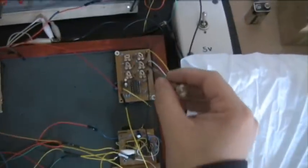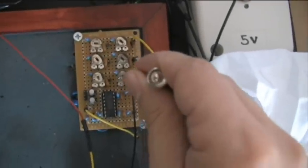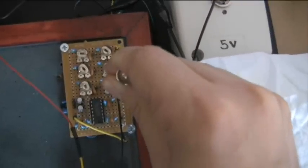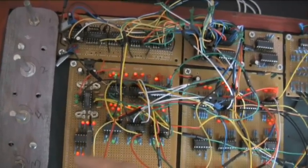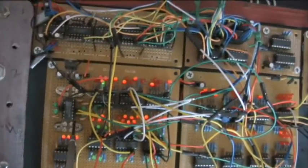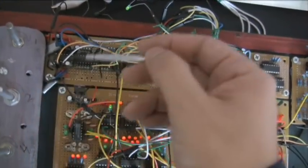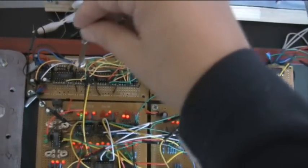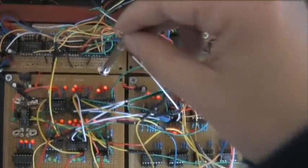First of all, I'm going to show you this. This is a really simple six-channel mixer built around a TL084. I'm just going to turn that off for a second. You start out with oscillators. Here are four oscillators built around the 4093 chip. Here's another oscillator here. This oscillator goes to four 4040 dividers, and these are three 4040 dividers here.